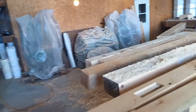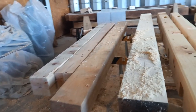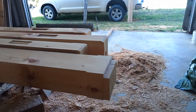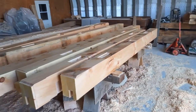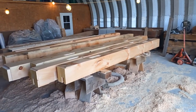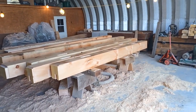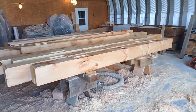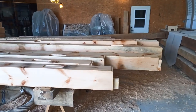So I really took advantage of that little room I have back there — I showed you in the last video — and I started laying out the queen posts and the main center aisle posts, then bringing them out here to cut. This timber was cut nine years ago, so it's very well seasoned, which means it's not going to move after I put it in the building. But it is incredibly dusty, so I'm not doing any cutting in that little room. I'm doing all the layout back there — it's early May and still quite cold on the fingers — and then bringing them out here for cutting, which is working out really well.